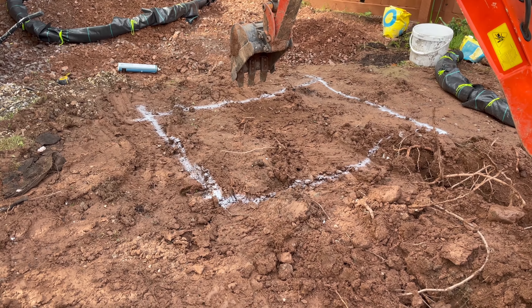We've had the delivery from Travis Perkins. We're filling up the trench with a couple of inches of clean stone, putting the pipe on top, then putting the clean stone back on top of that. That's basically a French drain — it's all sloping down to the soak away so any water on here is just going to go south. We've got about two inches of chippings down, pipe on top wrapped in the weed membrane. We put the earth back on top of it and hopefully it's going to pour down this afternoon.